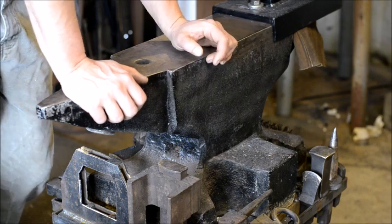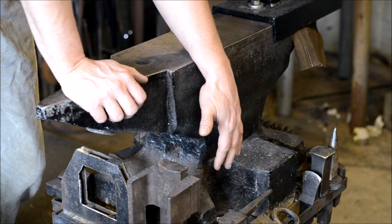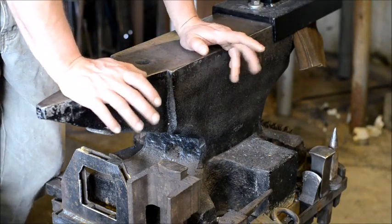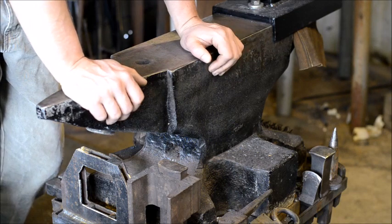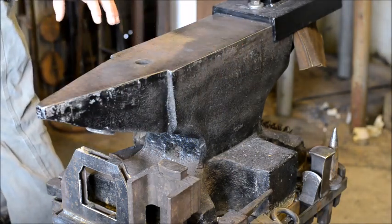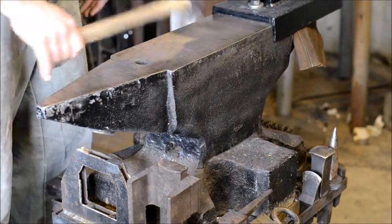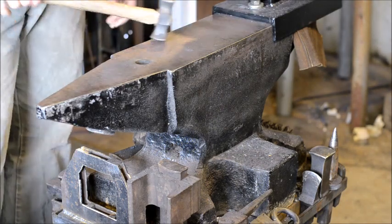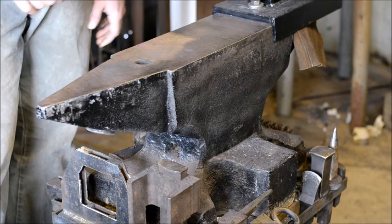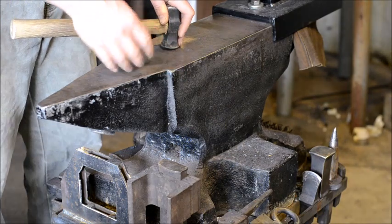It's a tri-legged design, and this particular one actually weighs about 325 pounds. I got that weight because I weighed it. So it is one heavy stand, and together it provides quite a bit of rebound and kinetic energy, which I'm super happy about. It's got quite a bit of rebound for a hammer, for an anvil, and no ring. And that's the nature of the stand. This thing actually rings like a bell. If you take this off and just set it on the concrete and hit it, it rings something fierce. But the way I construct my stands, it kills all that ring.